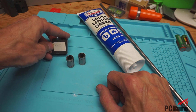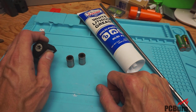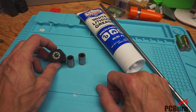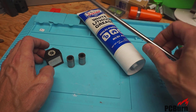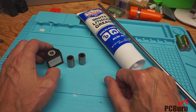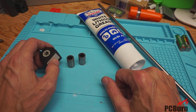I need to do more work on these, frankly. I don't think they're quite tight enough for the application, but the rods being a little missized sometimes actually causes probably more of a problem with these than anything else, so that might ultimately be an issue with cheap rods, although this one's from a printer. It's actually eight millimeter, strangely enough. The ones on the Prusa i3 Mark III weren't exactly eight millimeter, and that's what caused me a bit of difficulty there.